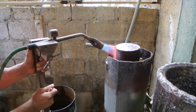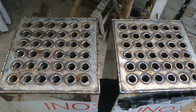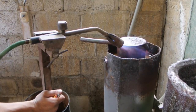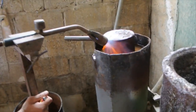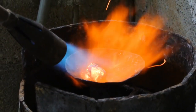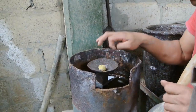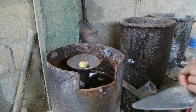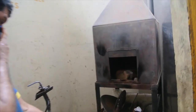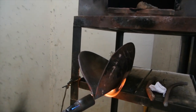Retorts come in a variety of designs, such as this cup and trough system, to larger water-cooled reverse flow systems like this. A miner in Alpache saw the need for more effective retorts, and has created a business buying and selling these high-end models. Unfortunately, not everyone is using these more modern retorts. After using the retort properly for 10 minutes, the miner opened the top to check on his gold, releasing the trapped cloud of mercury gas. Impatient, he burns the amalgam in the open air, so he can watch the color change as his gold becomes tangible, while releasing the remaining mercury into the air and our lungs. Miners do not respect mercury. It takes too long for them to see the detrimental health effects of their daily exposure. Instead, they choose to gamble with their lives and work in environments with one million times the allowable concentration of mercury in the air.